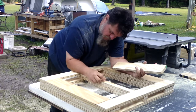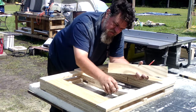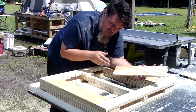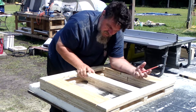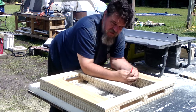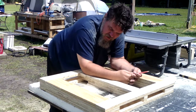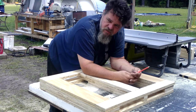Now it's skinnier here, and the only reason we got the thicker ones, see, it's this skinny underneath it, just to add for airflow. The only reason we're putting this thicker one here is because I want that piece of plastic, if it moves a little, to stay in contact, to keep that airflow going in whichever direction it thinks it should go. So eventually, basically we're adding additional airspace by doing this. It raises the fridge up about 3 or 4 inches. Well, let's see, 4 layers of 3/4 inch. That's what, 3 inches?